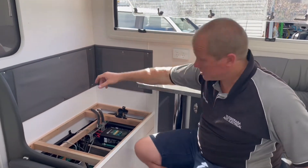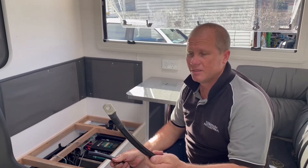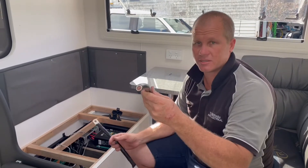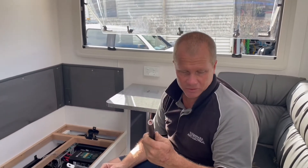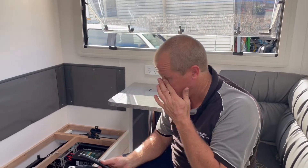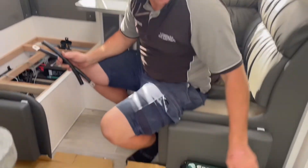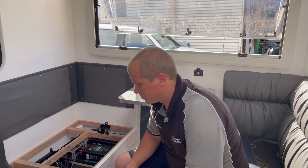Now there's a couple of things too. Here are a couple of bridging cables — I have made one up there. It's 95-square cable for this size inverter. You can see it's a double-insulated cable. 95-square-millimetre is the full cross-sectional area. We'll make bridging cables for the batteries to go from positive to positive and negative to negative, to bridge the two batteries, out of that same size cable, as well as the actual inverter cables.